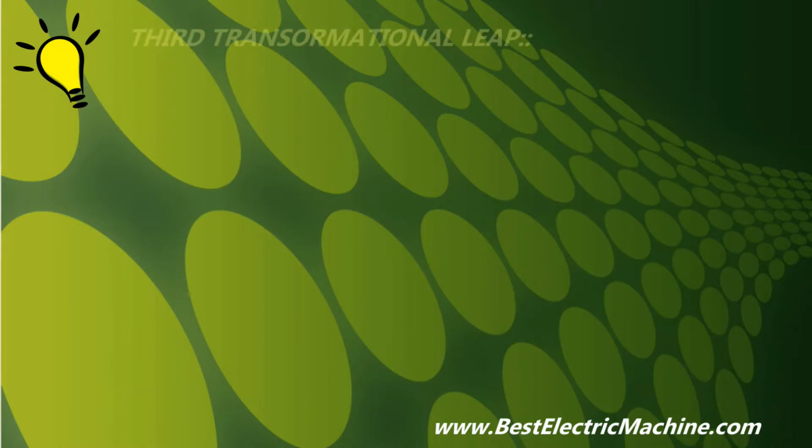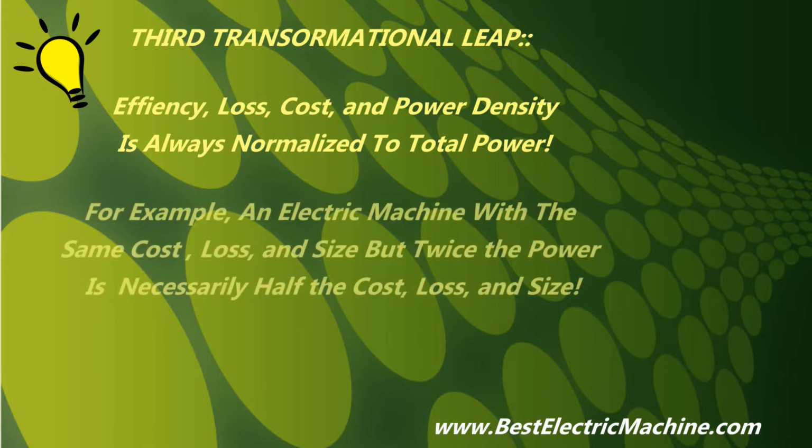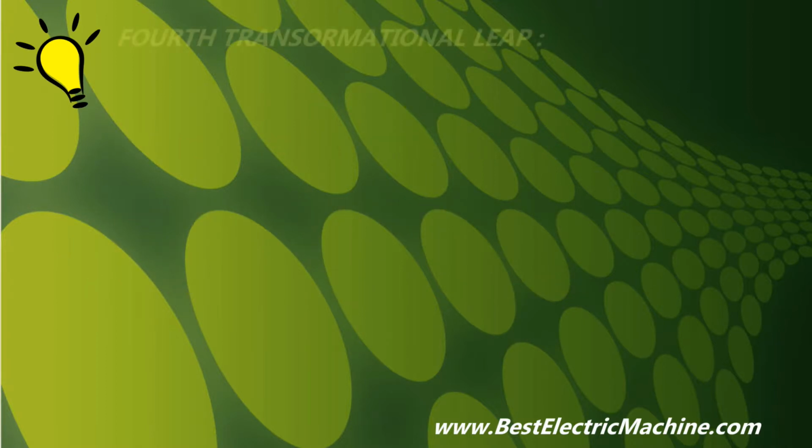Third transformational leap, since efficiency, electrical loss, cost, size, and thermal dissipation are always normalized to the power rating of any electric motor, the new electric motor with the collective power of two similarly rated active winding sets on the rotor and stator, respectively, reasonably evaluates to half the size and weight, half the electrical loss, half the cost, and half the thermal loss, per power rating, as the original standard induction electric motor, with the collective power of only one similarly rated active winding set.